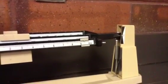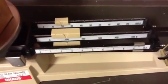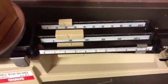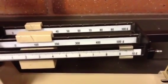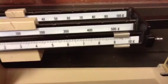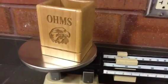Once you've got it balanced at zero, you read your triple beam by adding all the riders together. Your largest rider is at 100, so that's 100. The back one is at 20, so that's 100 plus 20. The front one is at 9 and 4 lines, so that's 9.4. That puts us at 129.4. The little symbol next to the numbers says G, which stands for grams. So we write down the mass of our object as 129.4 grams.